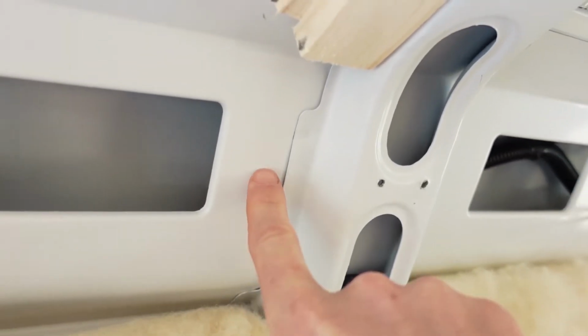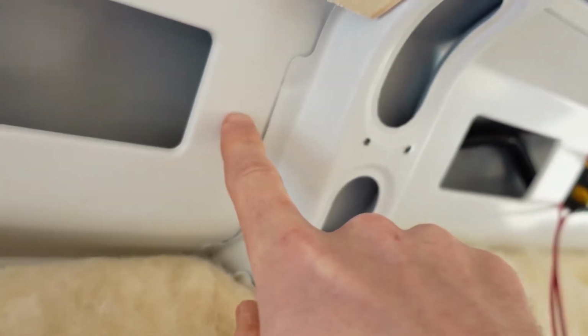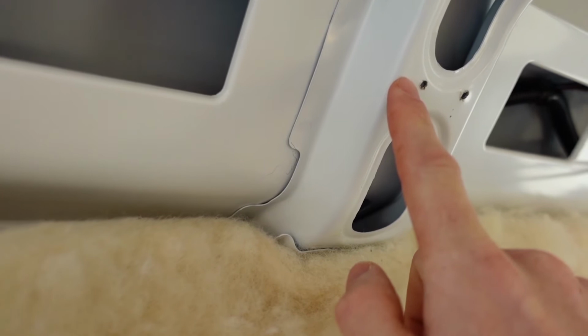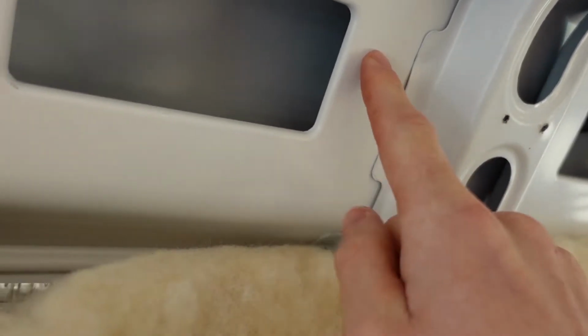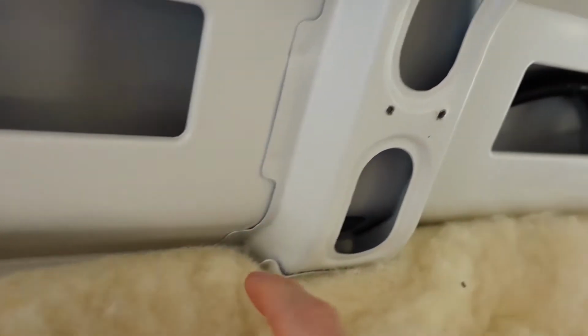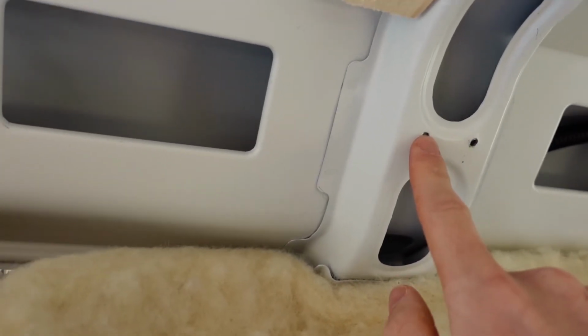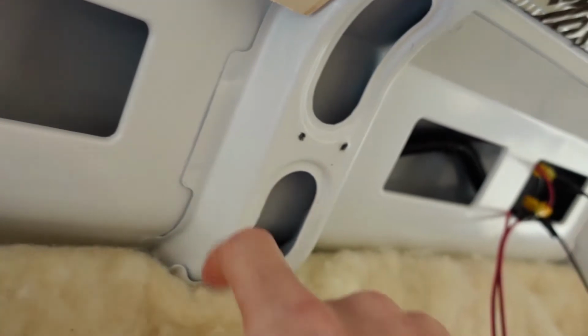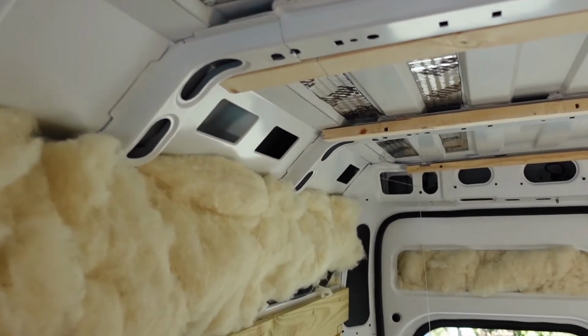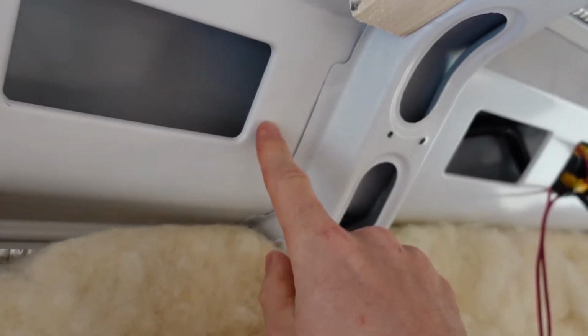We're about to start working on the upper cabinet furring, which we'll be attaching right in this area, and what we'll do is just put a strip that comes out just flush with this piece, and that way we can maximize our space. We'll be screwing into this rather than this, which I already tried, but this will be saving us like 1.25 inches, and in a van build the inches certainly add up. This is actually a pretty funky size.